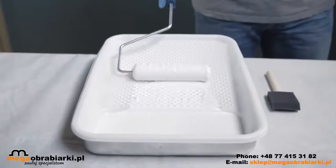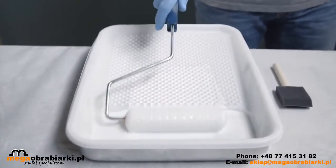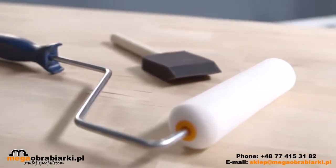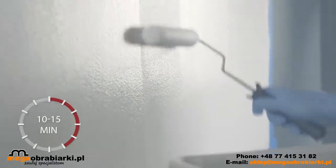After pouring the paint into a tray, use a dense foam roller designed to give a smooth finish. For smaller surfaces, you can use a foam brush. For best results, apply a minimum of two coats to light-colored surfaces and three coats to darker surfaces. Allow 10 to 15 minutes between coats.